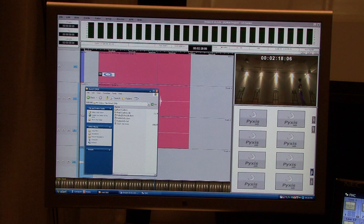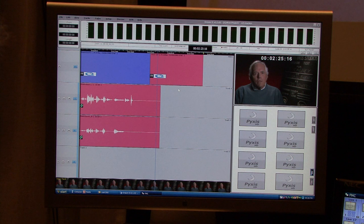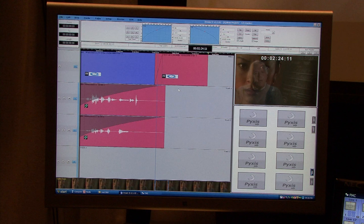Also included is a comprehensive sync and machine control system. We can lock to video references — both regular video and tri-level sync — lock to word clock and digital sync. We can chase LTC, output LTC, and we give you MIDI timecode input and output, all built into the back of the SX20 system. There's also a very sophisticated file exchange system where we can actually transcode files from one format to another, so you're ready to send a ProRes or QuickTime file off to your customer right from the heart of the system. There's no waiting — it's all included.